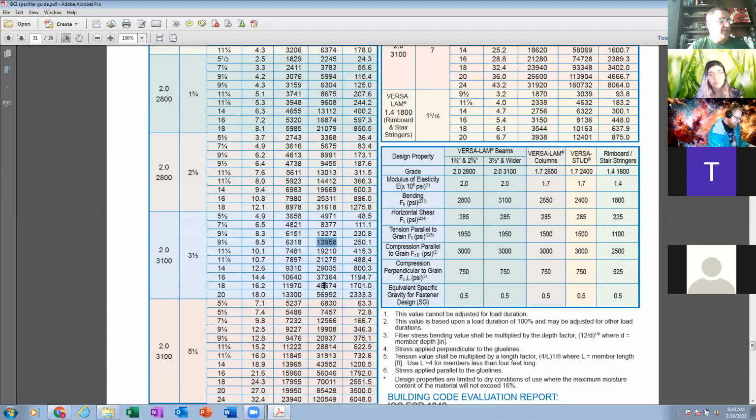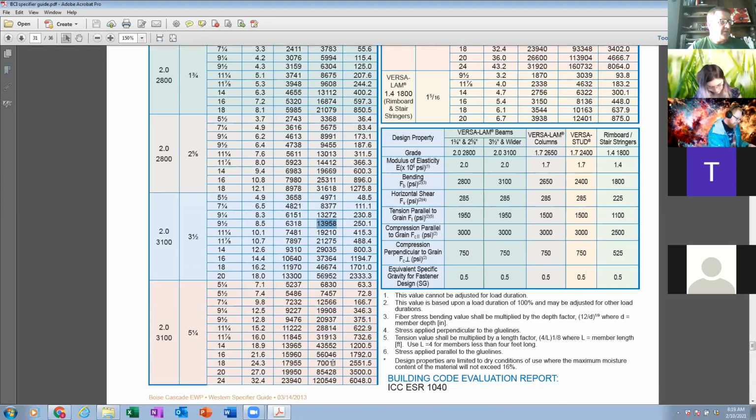So there's 4,600, 56, that's getting close. Are we up to 65? There's one, 70,000. There's our first beam. This is what engineers do. This is our first beam that would work. What is it? It's 5.25 wide by 18 inches tall. So in order to carry the weight that I just needed for that house, I'm going to have to choose that beam. Or notice there's some other ones. You can choose a beam that's plenty stronger than that.